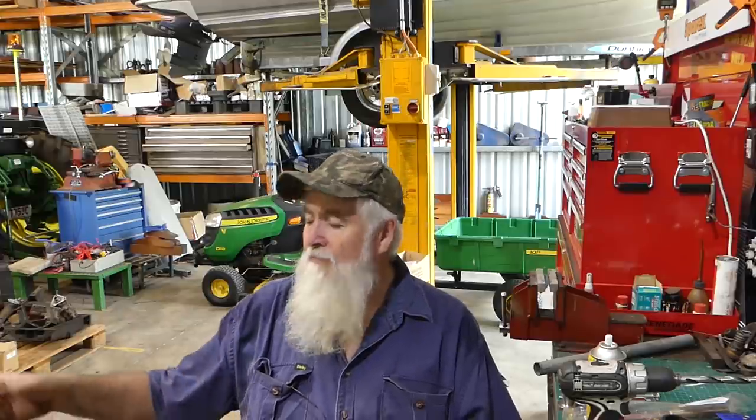Just pop that cam off, I reckon, as would be the simplest and easiest way to go. Those two bolts down the bottom, if you've got them wired or however you've chosen to lock them up, nip all the four bolts up, it's only half a turn, and pop that cam off and you're back to draft control how you'd like to be for ploughing. Then when it comes to position again, back them all off half a turn like we did, pop your cam back on. You could even scribe a line where that cam is now on my tractor, so that when I put the cam back on next time, I can just put the quadrant forward, pop the cam on, line it up with the line, nip my bolts up and away we go.